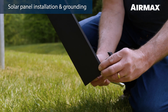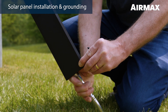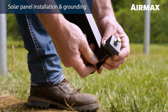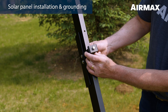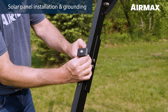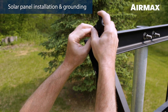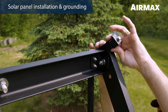First, position a single sided solar panel clamp at the bottom edge of one panel support rail extension. Do not tighten the top hex bolts, as you will need room to slip the bottom edge of the solar panel frame into the clamp. Repeat for the second panel support rail extension. Position one double sided solar panel clamp at the joint between the panel support rail and the rail extension. Place the second double sided clamp in the same position on the opposite support rail. Next, position a single sided solar panel clamp at the top edge of one panel support rail and hand tighten only. Repeat for the last single sided clamp.